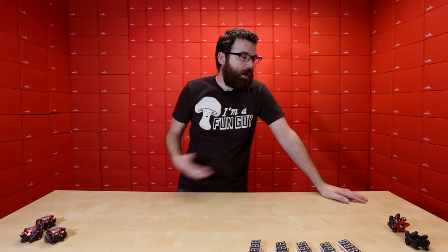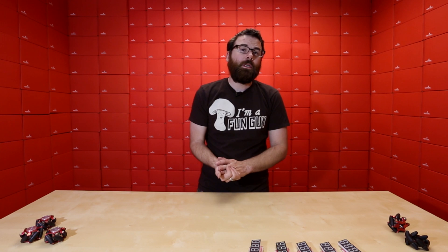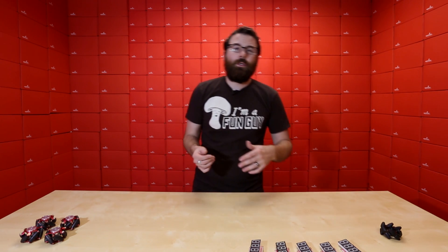These new ones are a lot smoother and actually use a single roller instead of the split design, so they run a lot better. We're actually working on a demo for these — we didn't have enough time to do it this week, and quite frankly we want to do it right. We actually want to use some kind of encoder on the wheel for a feedback system so we can make sure all the wheels are moving at exactly the speed we want. When we first tried it with the old ones, the problem was that without a feedback system and just driving with a gear motor, unless the front and back are turning at the exact same rate it kind of chattered and shifted. So you really want to drive those at exactly the same rate, and the best way to do that is with some kind of encoder. Give us a couple weeks to put that together and figure out the best way to drive these, and check out a demo in the future.